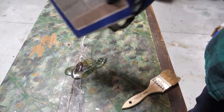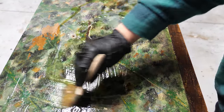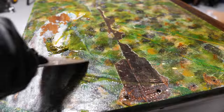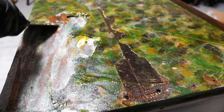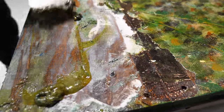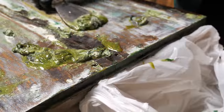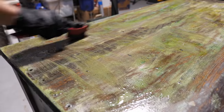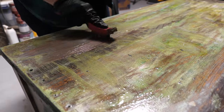Next, I moved on to stripping the paint off of the desk. I'm fairly certain the previous refinisher used acrylic craft paint on this piece over white chalk paint. I had to apply two coats of stripper and then scrub with a stripping brush on the second coat to get the second layer to come up. To neutralize the stripper, I used afterwash and steel wool.